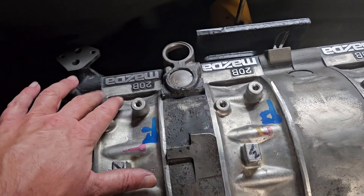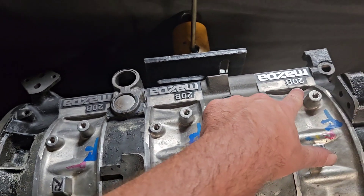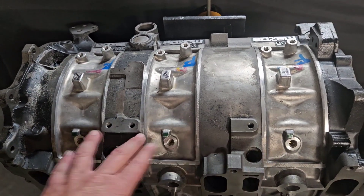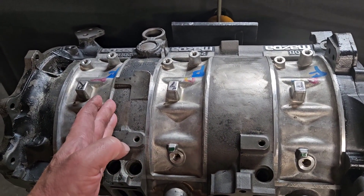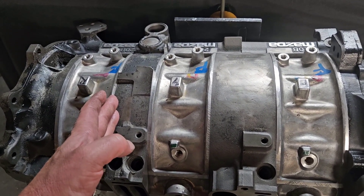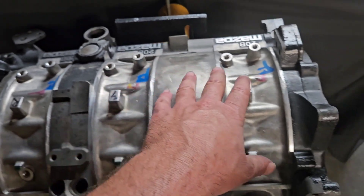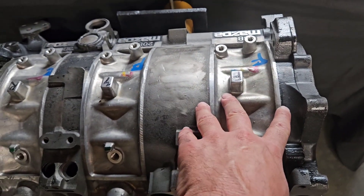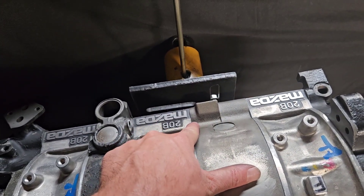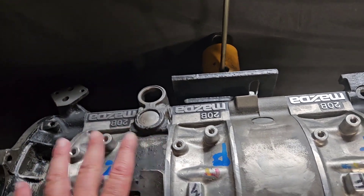Reducing the expansion helps eliminate the issues of cracking that run along your oil dowel pin galleries and within the cast iron components of the block. And similarly, by eliminating twist, you have better sealing of your water jacket to housing seal — which would be your head gasket seal essentially. You also reduce the risk of having the block twist and crack components or lose strength in critical areas, which can cause sealing issues, failure issues, block cracking, exploding, or leaking.